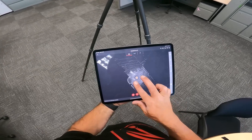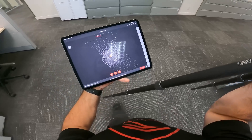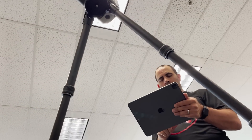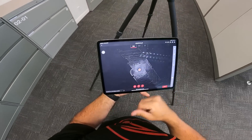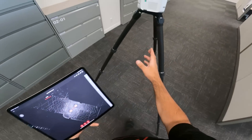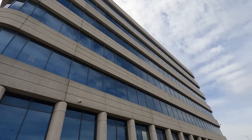Almost immediately upon finishing the two operations, a truncated version of the scan will appear in the app, enough for you to get your bearings. Your setup locations will appear as red dots on the map, and you can now see the scanner's location on the map when moving to its next setup location. The scanner will track its location from one spot to the next using the various sensors that are built in. After the second scan is done, you'll want to confirm the automatically generated position by clicking Quick Link and then move on to the next. With this workflow, scanning even the most intimidating site becomes a simple and straightforward process.